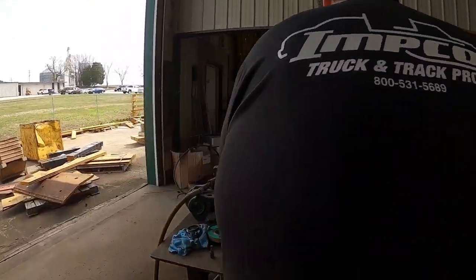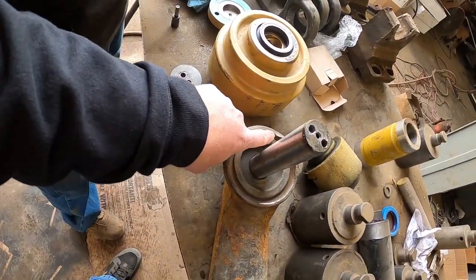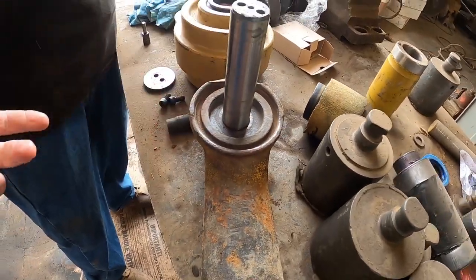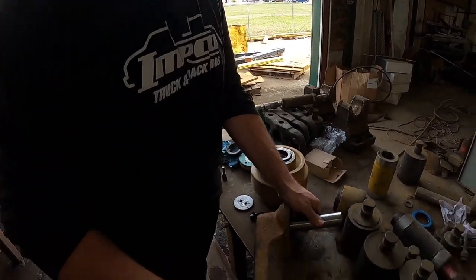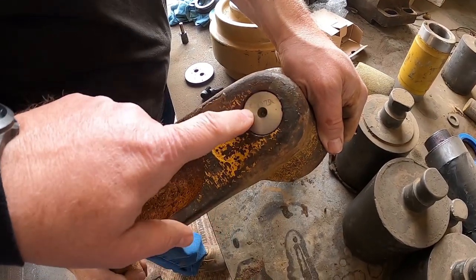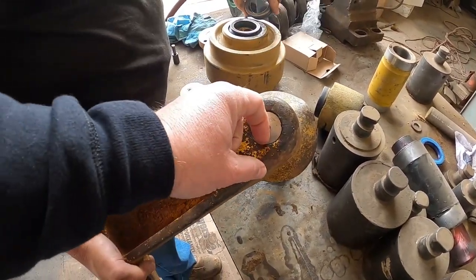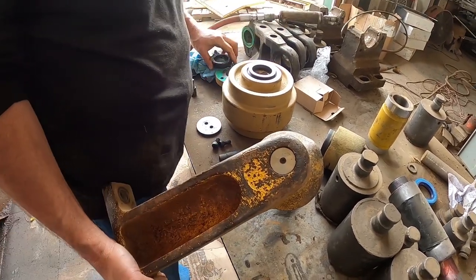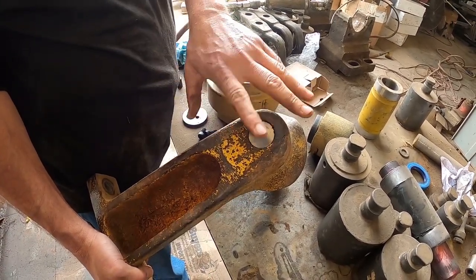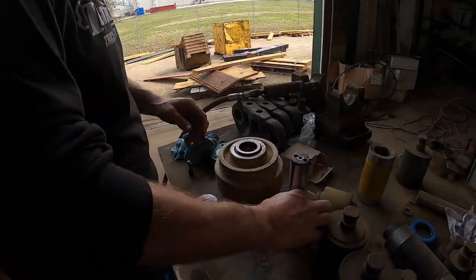Barry cleaned up the surface with a wire brush and ground it back a little bit. He pressed the shaft in until it bottomed out pretty much. You can look back here and it's almost to the end. There'll be some testing — you've got to put the roller on and see if it's tightening up on the dual cone seal. This seal runs metal to metal, so it actually doesn't bottom out. You've got to do a little testing to see if it's going to be tight enough. Sometimes it'll be flush, sometimes it won't. So the seal itself is going to tell you if it's tight enough.